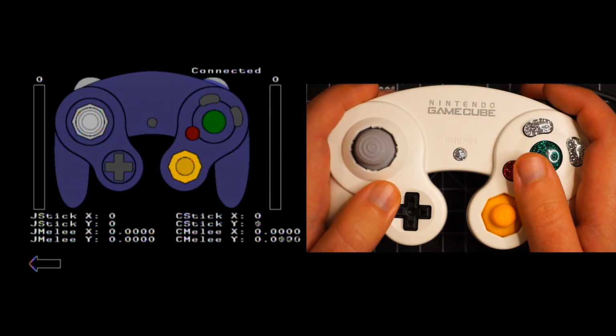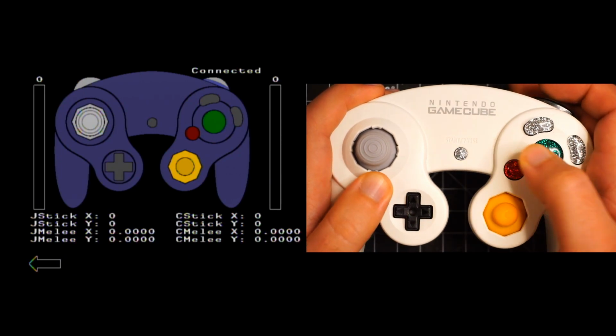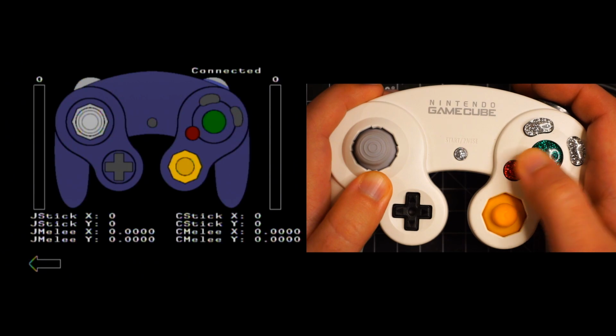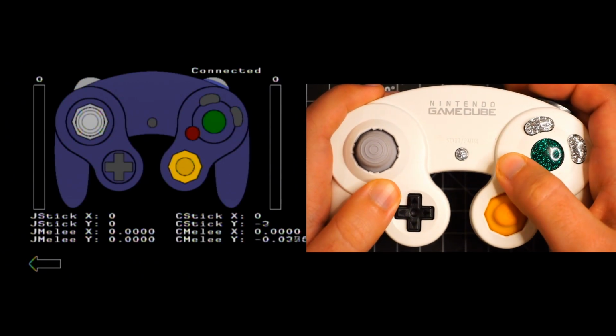How to remap buttons. To remap buttons, hold start and D-pad left for 2 seconds, then press 2 buttons in succession. Right after, those 2 buttons will be swapped. You can swap the button again with another button to swap the functions of even more buttons.